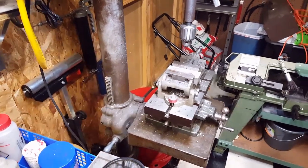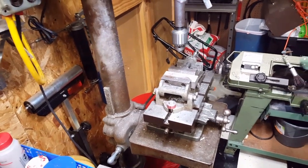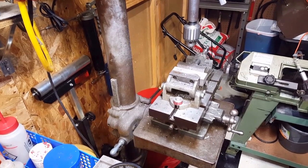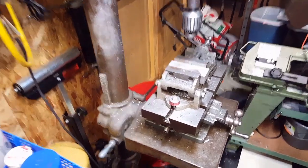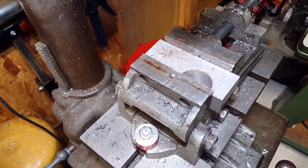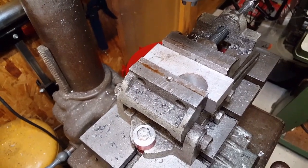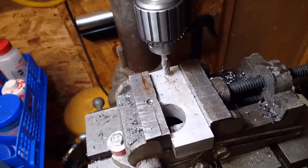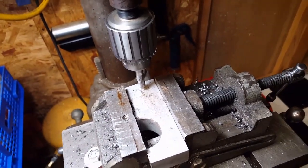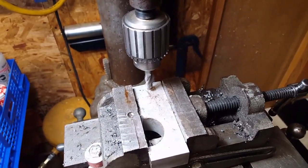In a couple of tasks, we are going to plunge drill with a 3/8 and 1/4 inch carbide end mill, and we are going to try to cut a slot into this piece of aluminum. Then we'll take it over to the milling machine and mill the piece of aluminum. This is the plunge cut we're going to make — a 3/8 inch end mill in a Delta drill press. Let's see how it plunge cuts.